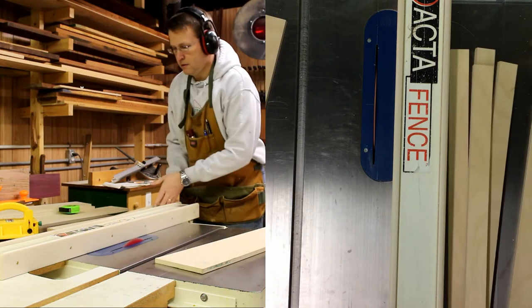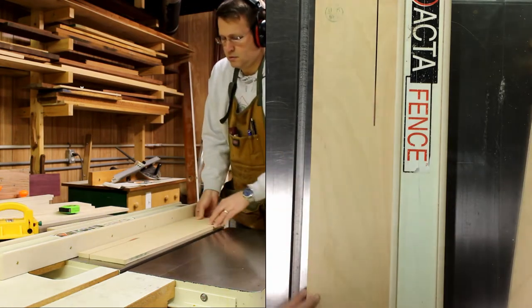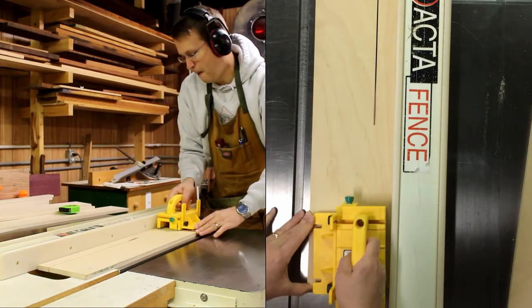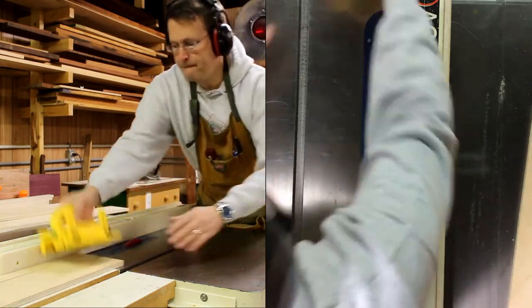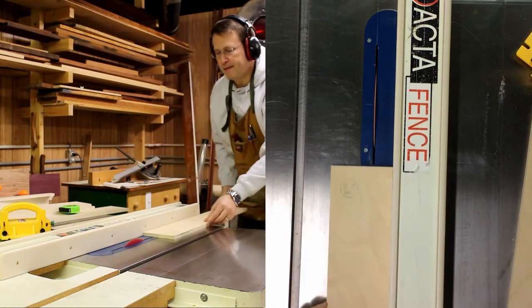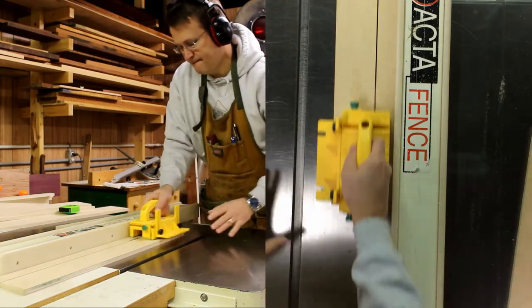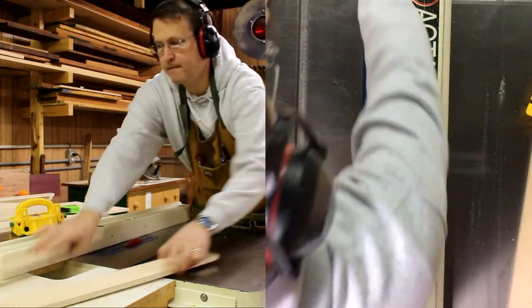The dimensions of this box are approximately 20 inches by 14 and 7/8 inches. The 14 and 7/8 allows me to get eight rack units high with an equal spacing on the top and bottom, and the 20 inches allows me to have the 19-inch wide rack standard with about 5/8 of an inch on each side.